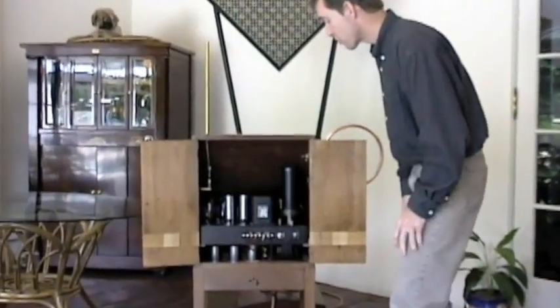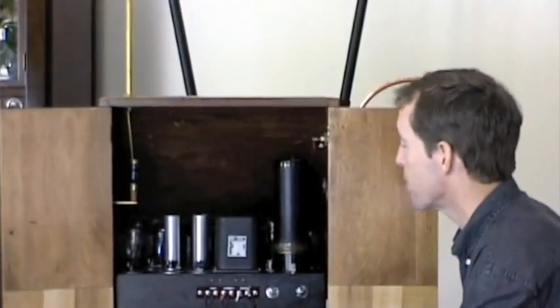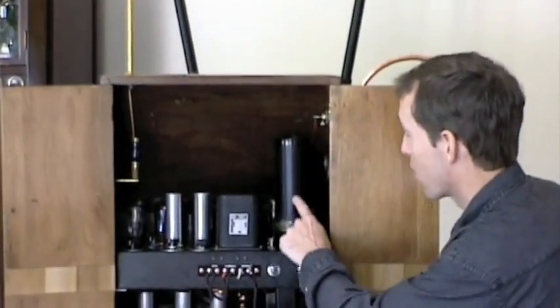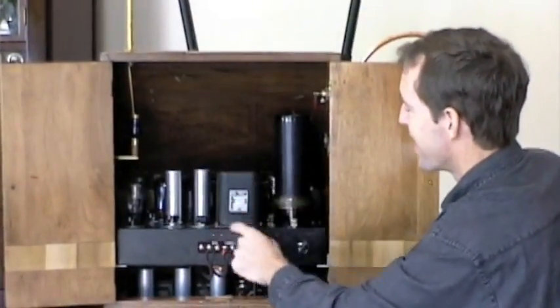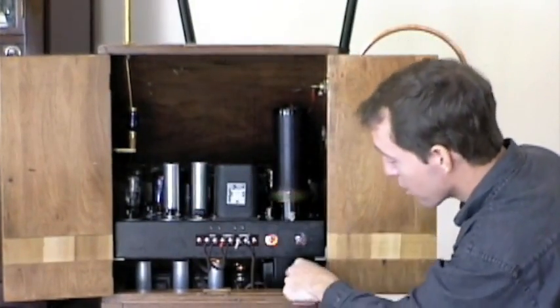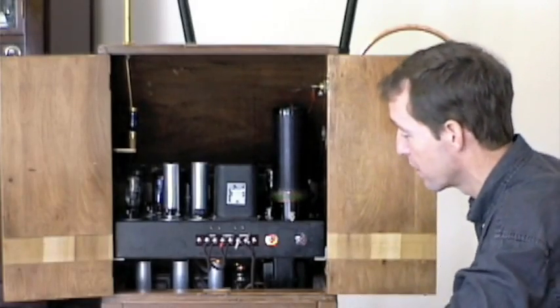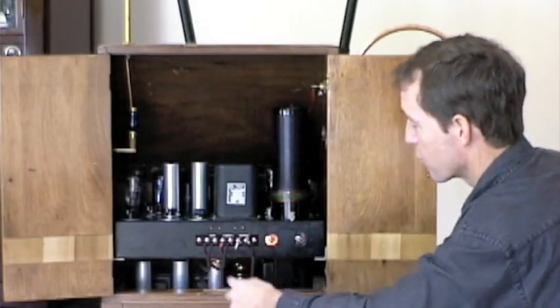So this is the theremin chassis — this is Philip Stout's work, and some of mine too, though most of the visual elements are his. This is his coil; this is my coil. Output transformer, capacitors, and various tubes and transformers. Down below is another chassis with a big power transformer and a rectifier tube, and some wires to interconnect the two chassis.